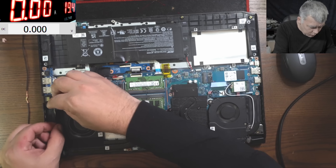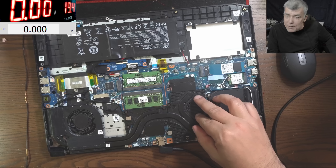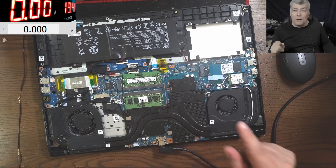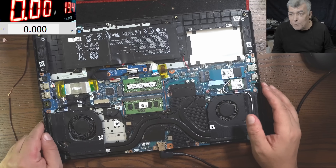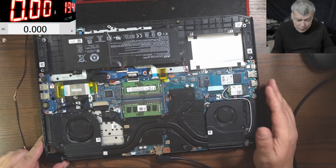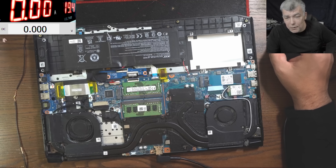Is there anything more we could do for this customer? I've been down that road — I replace VRAMs and whenever a VRAM is dead, the GPU is dead too. I'd be happy to replace the GPU if you can provide a good quality chip. Otherwise we have experience buying chips from AliExpress, and that's not a good experience. So I'll stop here. Thank you for watching — I'm happy I helped this customer, at least he can still use the laptop on Intel graphics. Like and subscribe if you enjoyed the video, and see you on the next one. Bye!